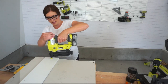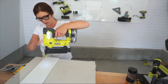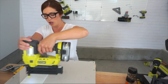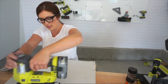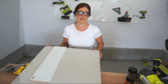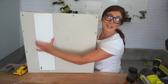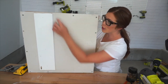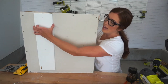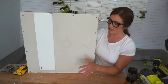So if I install this directly onto studs — this is only three brad nails — if it's directly onto studs, you can see right here this piece is not coming out. It is solid, it is secure. There's very limited gap here on the side that is easily caulked, and you're not going to worry about hitting any type of electrical or plumbing.